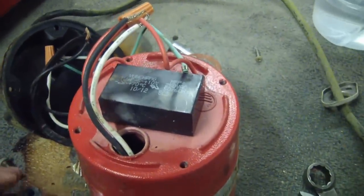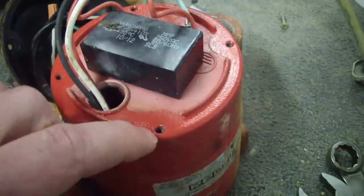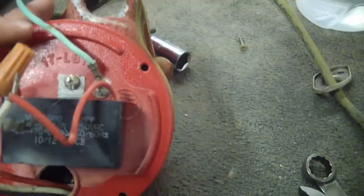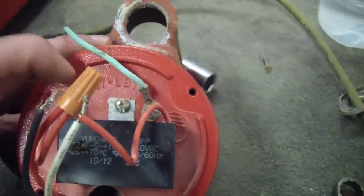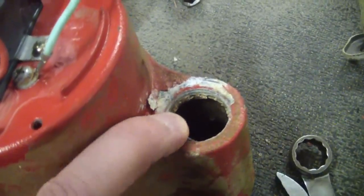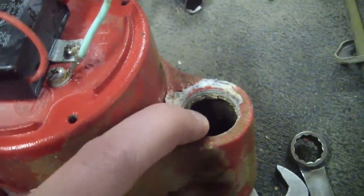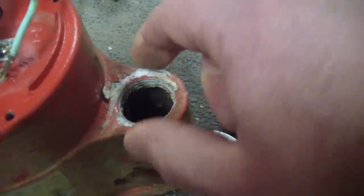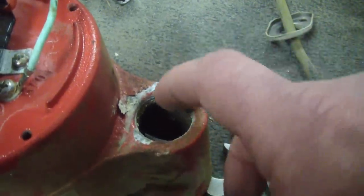Hearing that squealing, I knew right away it was a bearing noise. This is an aluminum casting — beautiful, heavy, powder coated with a nice thick hammer-tone textured powder coat. We can see a little bit of the white death, but no green death on the wires, and some white death on stuff touching the aluminum. Here we have the outlet — it's a threaded pipe connection. Pipe is the worst fluid connection you can possibly get, but it's cheap. The reason it's the worst is because there is a leakage path all the way up the spiral root of that thread form, so you've got to seal it up with something physical or Teflon tape.